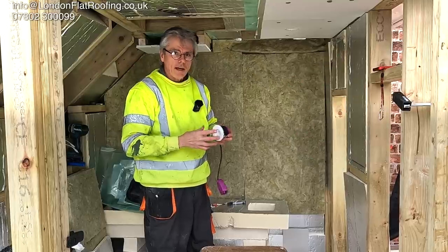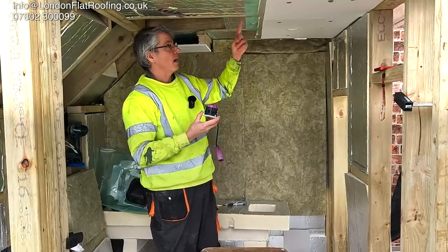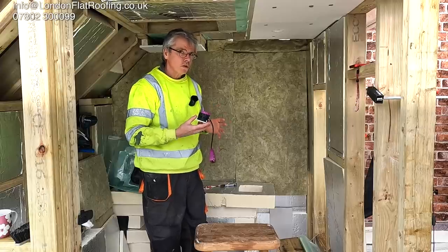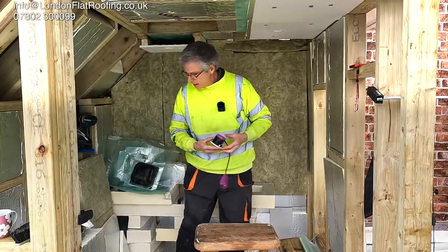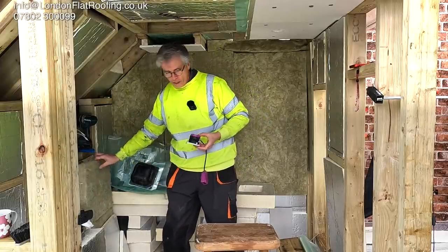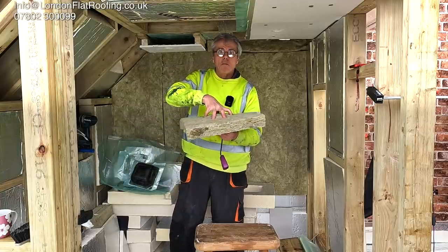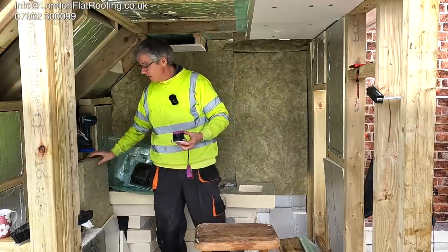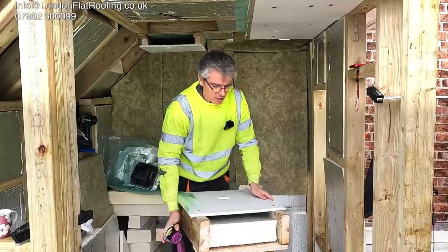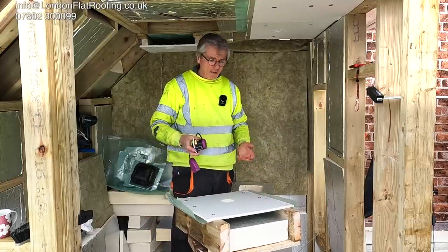This is pretty sealed with a heat sink on the back, and these are sold as insulation coverable. That's something people go great about - insulation coverable - but you've got to talk to the manufacturers and ask what that actually means. What it actually means is that it gets covered with something like this in a loft, and they've tested that - that's what insulation coverable means.